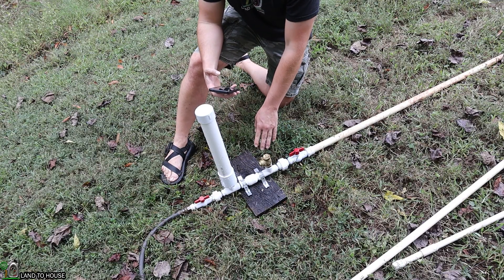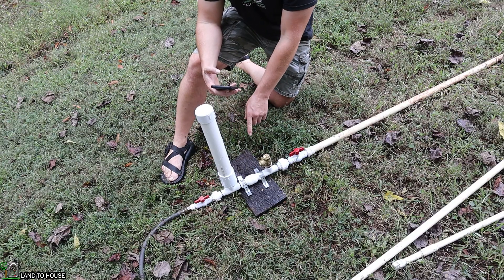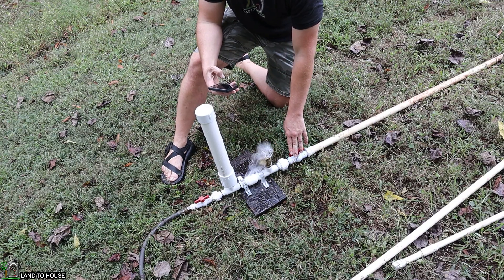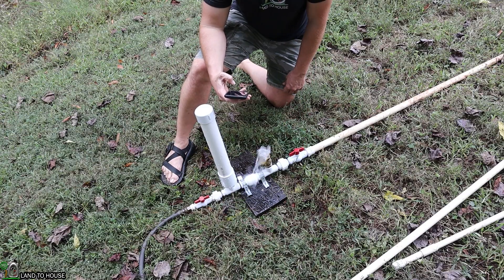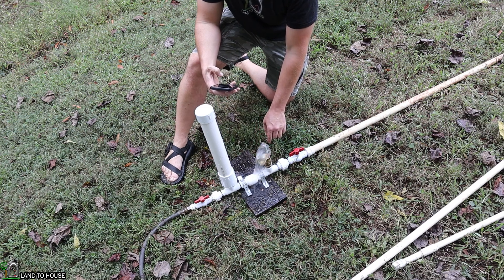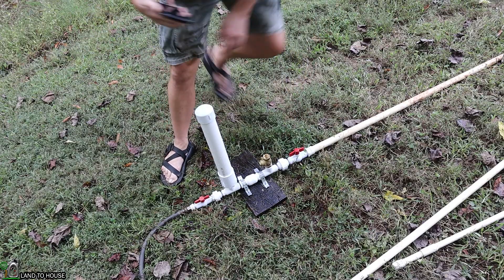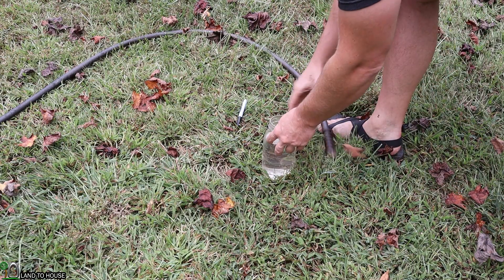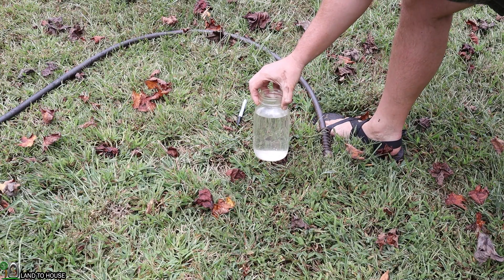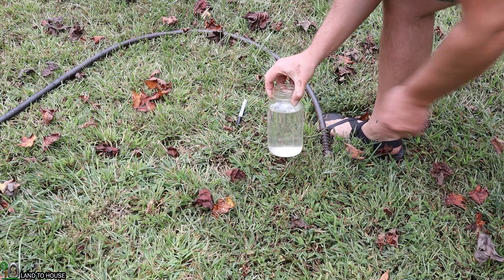I'm going to go stick the jar at the delivery and be down here and let it run for 30 seconds and see what we get up top. This is what I expected with the bigger drive pipe — for the valve to stay closed all the time. Keep in mind I have four different sizes of the ram pump available — I'll have links in the description below. All right, 30 seconds. The results are in: with the one inch we were just slightly less than the three-quarter inch drive pipe, probably because I had to start it so many times.